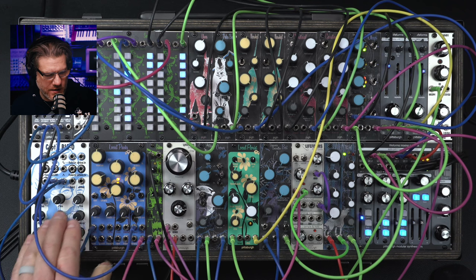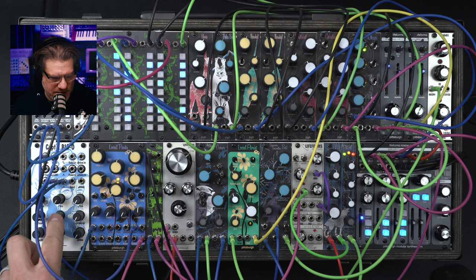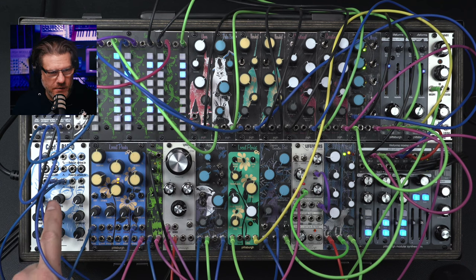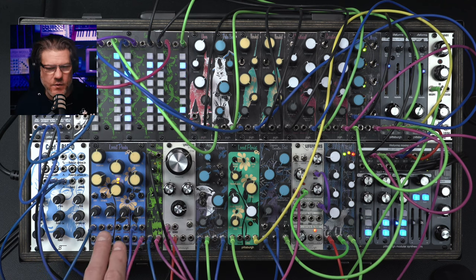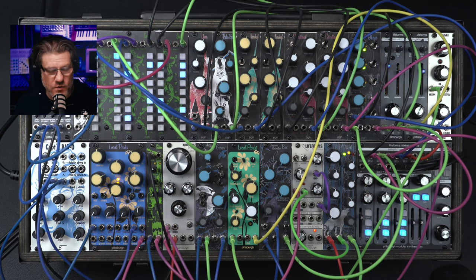Actually, it's the same oscillator core as Captain Big O, which is right over here playing our bass. But beyond that, everything is totally different. With all of the oscillators that we're doing now that are interesting or unique, really it's the wave shaping that's unique. Our core hasn't really changed in a while, because it works, and I think it sounds good. It creates a nice saw wave, and from that we can shape it, and it's stable. So this takes that saw wave we create with our core and creates some really interesting waves with it.